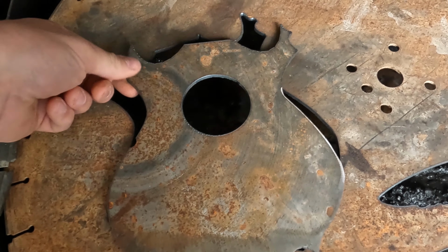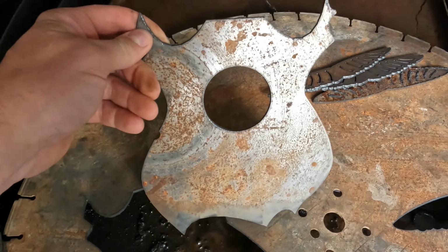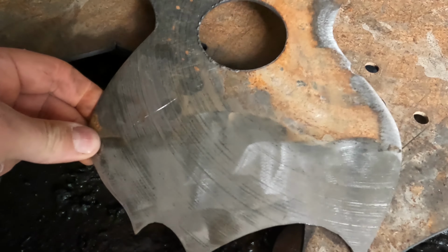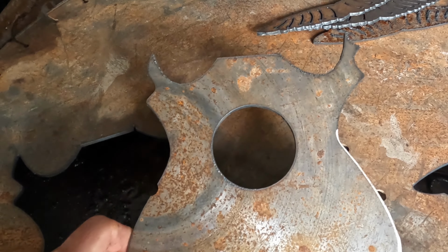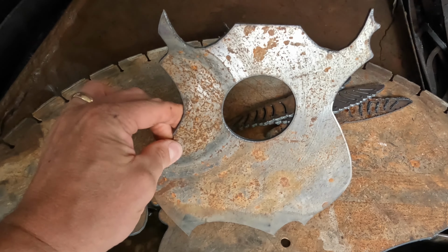This is a sketch my daughter drew. This is the exact shape. This is her ukulele she wanted, so she drew this shape to scale. I transposed it into a CNC program, essentially by mapping all the coordinates of our sketch on a little XY grid. And then I use some Bezier curves, some blending functions in my CAD program to get these shapes, and then I cut it out of my CNC plasma.